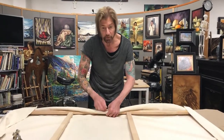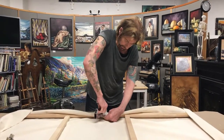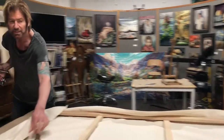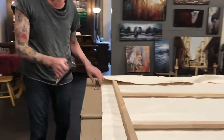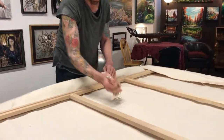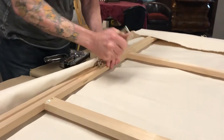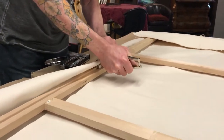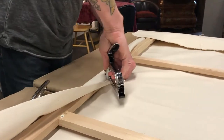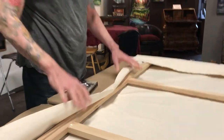You don't want too much tension here — we're going to give all the tension to the other side. These are heavy-duty staples from a heavy-duty stapler, about half an inch. We'll go to the stretcher claws — there are different names for these things. Dig the heel into the stretcher, hold it with your thumb. Now you've got four-way tension.